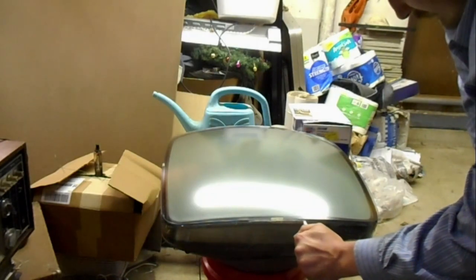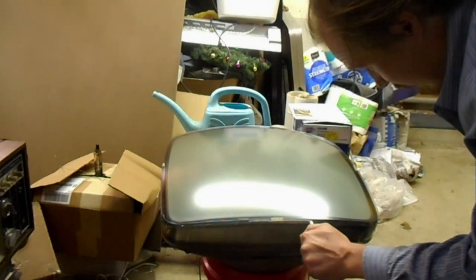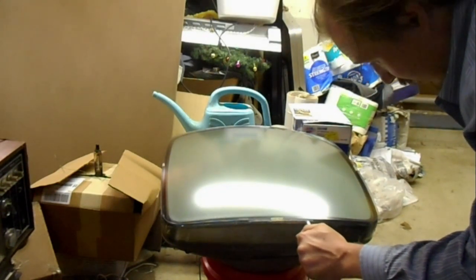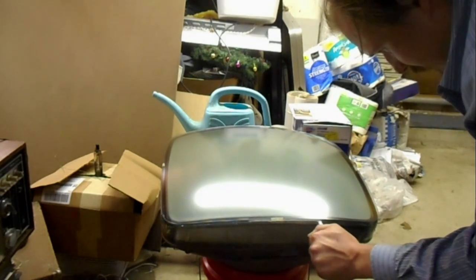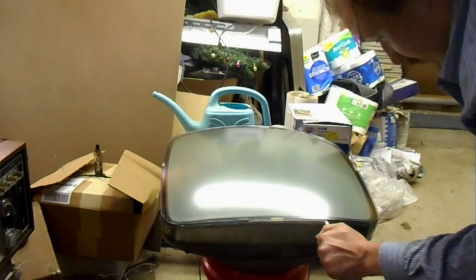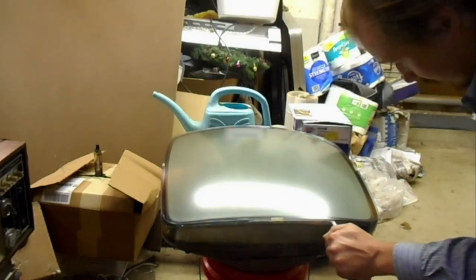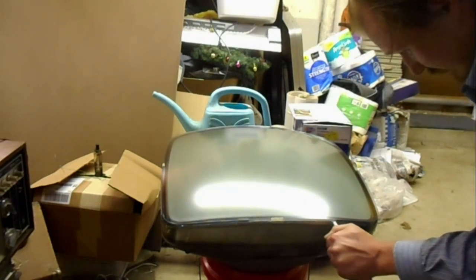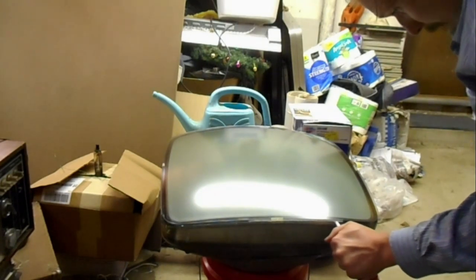If there's any dust or lint in there when you seal it up, that dust and lint will be there until you tear the safety glass off again in the future, which, if you're me, you'd probably prefer not to do. I have CRTs that have had the cataracts removed and have been caulked 10 years ago that are still flawless.